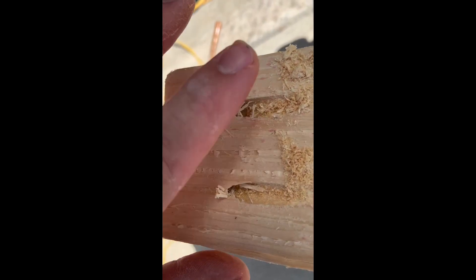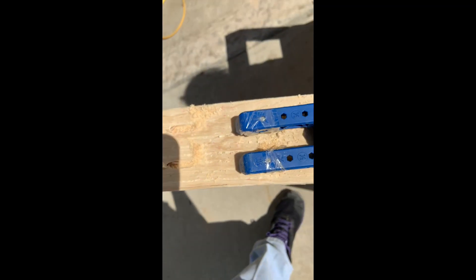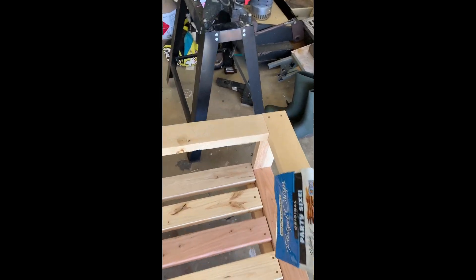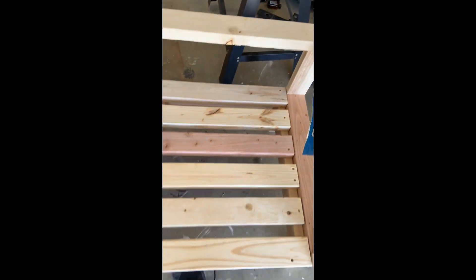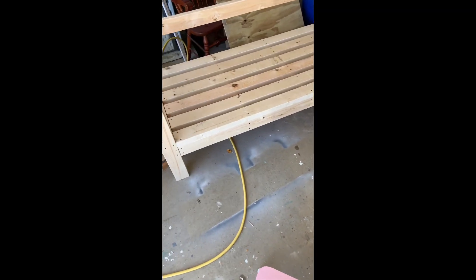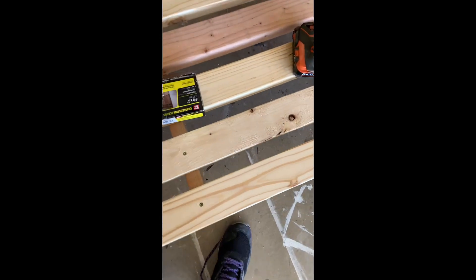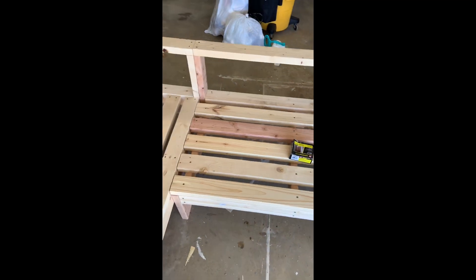The screws go right inside and sit flat up against the board — very simple. After drilling the pocket holes, went ahead and finished putting the backing on, then put the seat slats down again just like the other one, spaced out with a 2x4. I went a little overboard with the screws on this one — I put two in each — but they're not moving. Actually I put one in each; I'm not as worried about these.